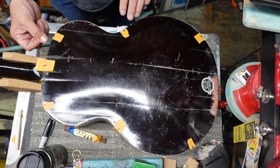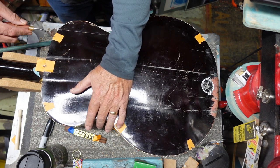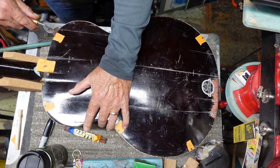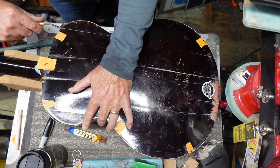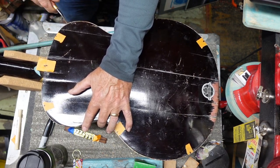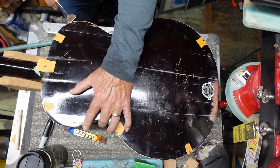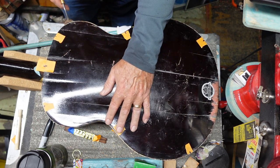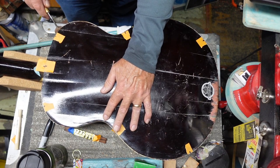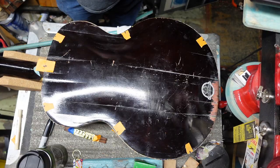But we're just going to keep heating this up using the hot plate. And you can tell the hide glue just cuts loose, and that's why we use hide glue, and we're just walking around like so. There we go. Now, when it starts moving, you want to be careful that these places where we've fixed cracks, if you start prying instead of working the glue loose, you're going to re-crack things, so use your patience.